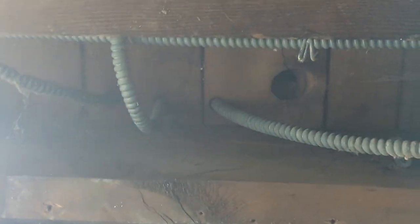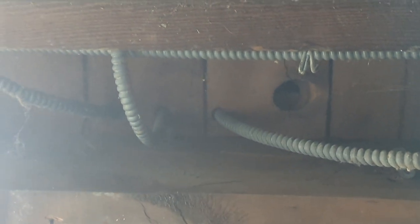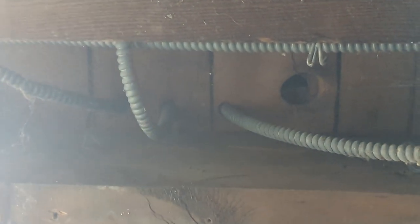So to avoid having to make a decision there, what I'm going to do here is move this electrical over so I can slide in and add a layer to this first joist on our side of it first. All I've got to do is go up and drill. I'll drill to the far side of each one of those penetrations with a 3/4 inch bit or something like that, near to the hole. And then I'll just cut over to it with the oscillating tool carefully and make a pill shape so that when I come sliding through with the second joist, I can just move those things over and we can leave this armored cable wherever it may go.